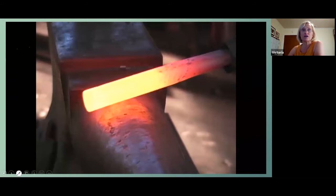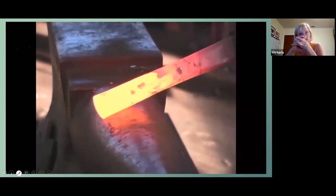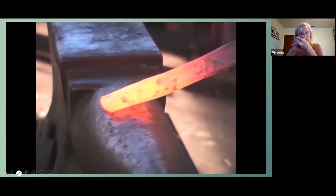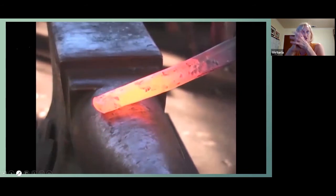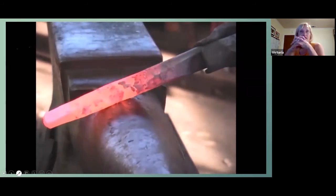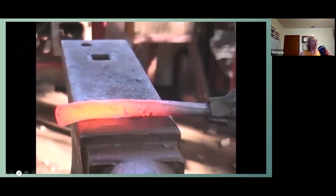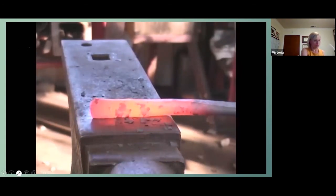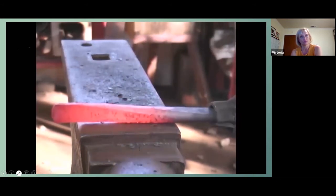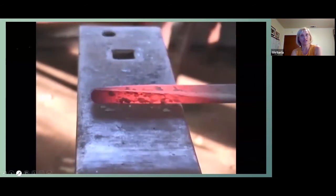Let's watch a video of a slot punch being made. So removing that extra material and then just starting your taper — it's just a chisel point taper, keeping the end in check. We don't want to pass whatever your prescribed amount is; in this case it's seven-eighths by one-eighth inch. All surfaces should be nice and flat.